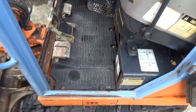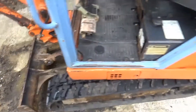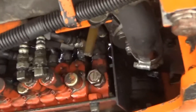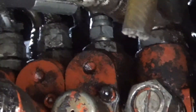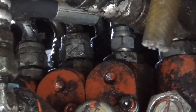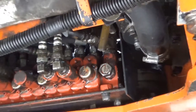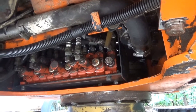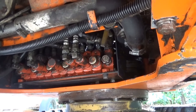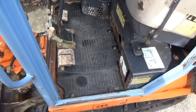So we got the floor back in and fitted back up. You can see the remnants of the old oil down there, what's left of it. We've got the new hose back on underneath — which is up in there, that one there, the smallest one. Luckily they put a smaller end on it so you can get a spanner on easier, instead of using a bigger spanner like the other ones where you can't get a spanner in between them. So in the future it'll be easier if the one next to it goes — it's now got a smaller fitting on it. We can get back to work with it now and hopefully it should be alright.